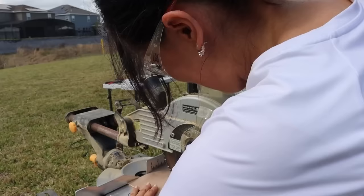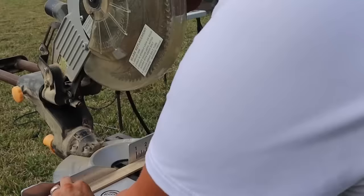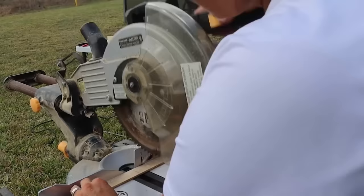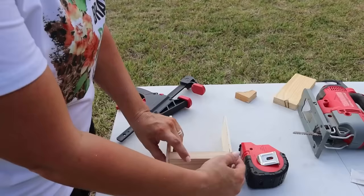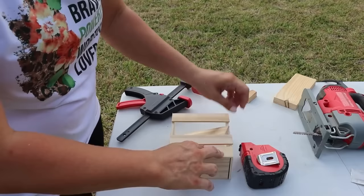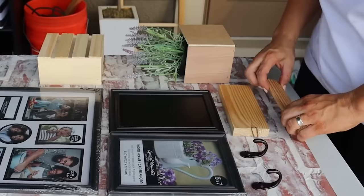Next up, I wanted to put in a letter holder. And so what I did for this is I cut down that same 1x3, I think is what I used, cut that down to the same width as our box below it, and then did some thinner side panels again and cut that down to size. And then I used some paint sticks for the front to give it a crate effect. And then I ended up nailing that all together as well, and no back again on that as well. The next element was a little pencil ledge or a chalk ledge.